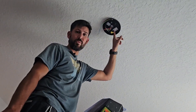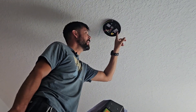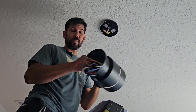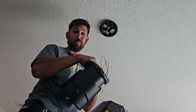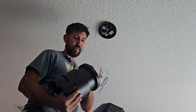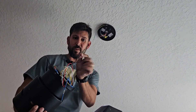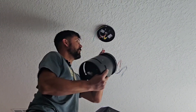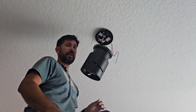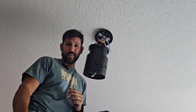I just got the ceiling mount installed — two screws right into our bracket in the ceiling — and got my wires pulled through, with the power turned off of course. One thing about hanging fans is sometimes it's a pain and it's a two-person job. One thing I see right off the bat that's actually very nice is there's a hook on the bracket and a wire with a little eyelet on it, and you literally just hang it over the hook. Now I can wire it up without needing an extra set of hands. Pretty cool.